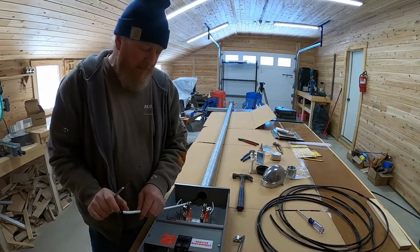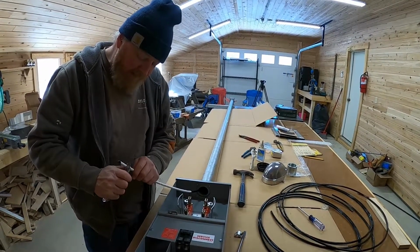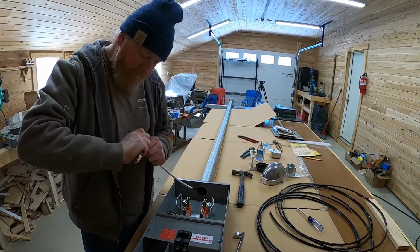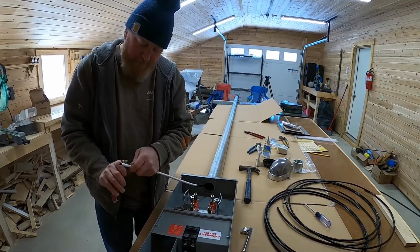And I like to strip my wire a little longer than the socket it's going in, so you can see copper out each side of it. That way at a glance you can make sure you didn't get your insulation in under the wire.